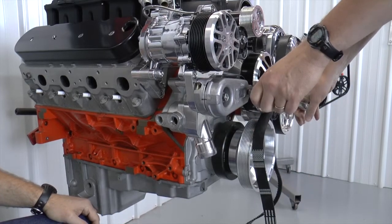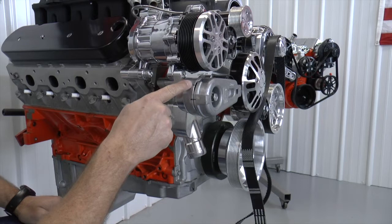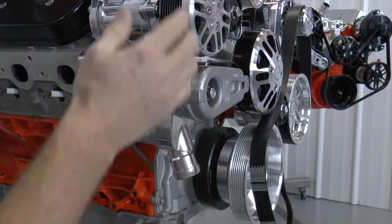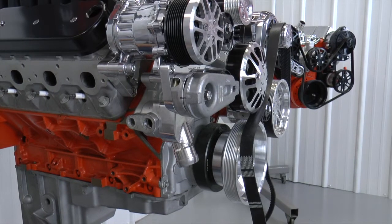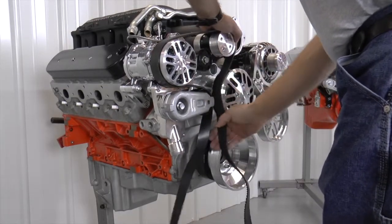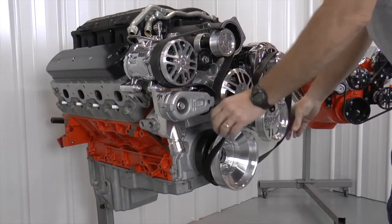We're going to release the tensioner and we will put a new belt on. What we've figured out is we need this belt to be actually hard to get on. I'm going to show you where to put it on and what we're looking for. Obviously, 50% of the travel would be right in the middle, but what we found is we really need about 60-40. To be able to get a belt on it, that thing's going to come back to about 40 and we need 60% travel to even be close to what we need. These belts have to be tight — otherwise we're definitely going to have some slipping problems.